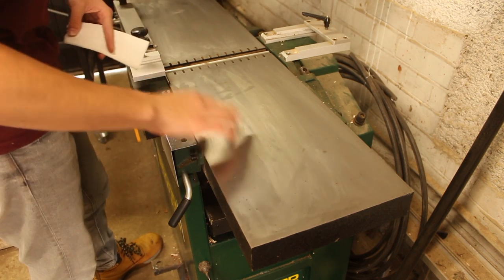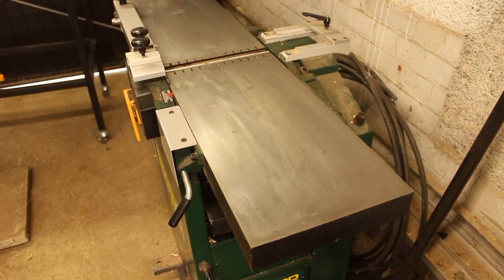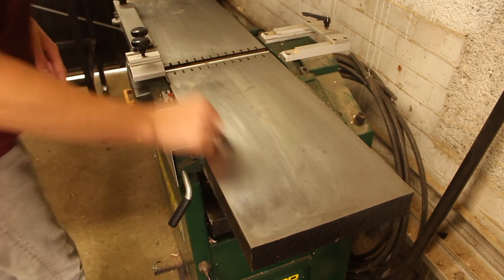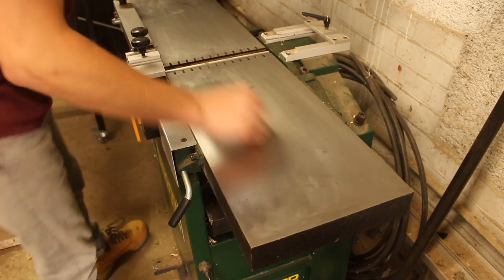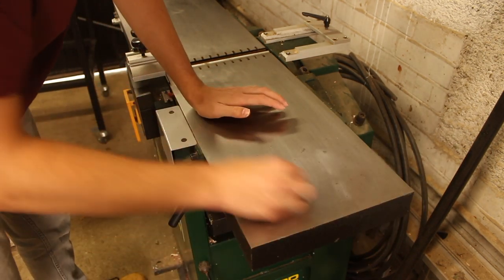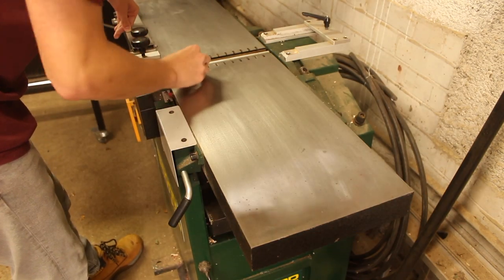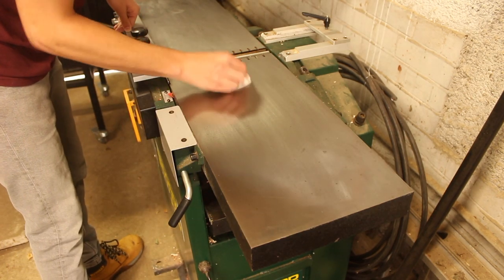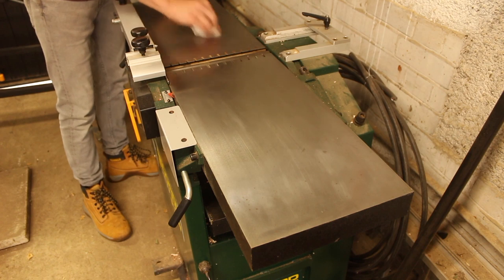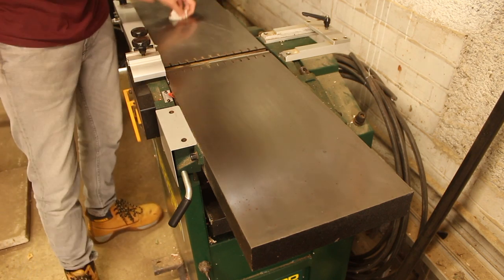Buffing it doesn't remove all of it — it just makes it smooth. As you can see, as I buff this side it gets much shinier and much smoother. I do this maybe once every two months, which is probably not what I'd recommend — you should do this as much as possible. If you were to do this once every other week, it doesn't take long, and it would be fantastic for your machinery. The wood will glide much easier over your cast iron tops. And that is how easy it is to apply this machine wax. I'll add a link in the description below if you want to check that out.